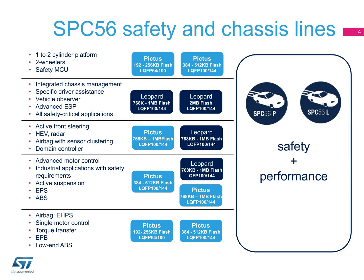Going into more detail in each series, we show an application mapping of our chassis and safety MCUs. For example, we can see that for a safety application in two-wheeled, one- or two-cylinder vehicles, a P-line Pictus MCU with up to 512 kilobytes flash would be suitable. For safety-critical applications like advanced electronic stabilization programs, the L-line Leopard devices, such as the SPC56EL70, come into focus, offering up to 2 MB of embedded flash memory and ISO 26262 ASIL-D compliancy. Our portfolio spans a range of memory sizes and packages, and is designed to allow you to find the MCU that exactly suits the chassis and safety device you are designing for.